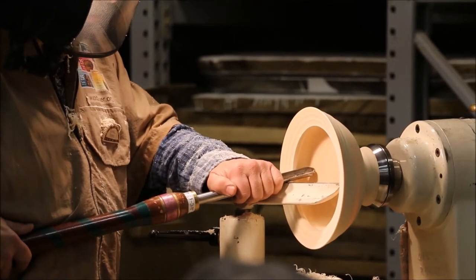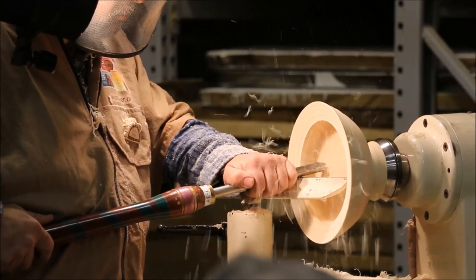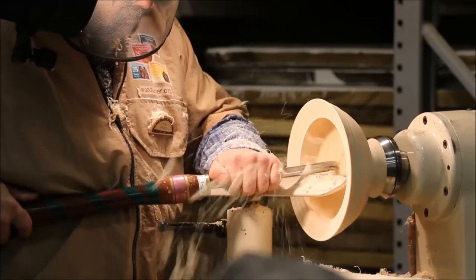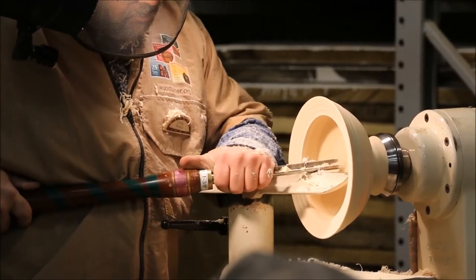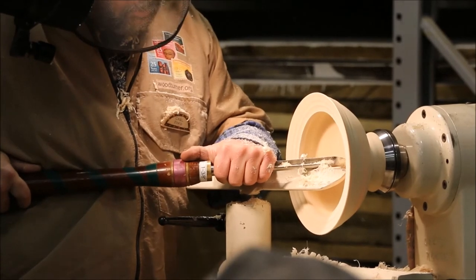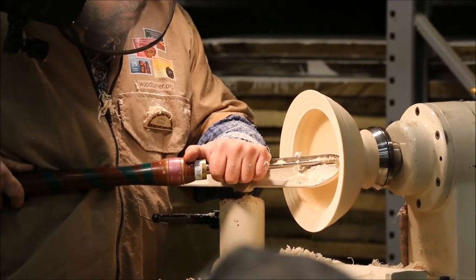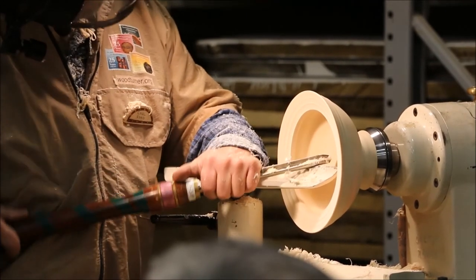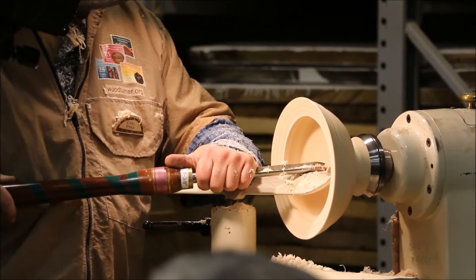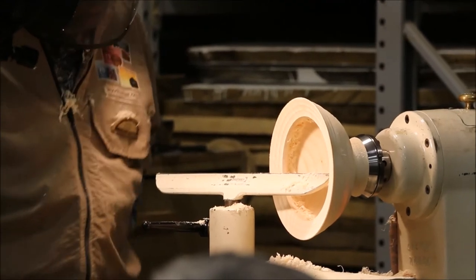So that's what I'm doing each time in here when I start the gouge. I reach in here — it's not starting, it's not cutting. I'll bring the back around a little bit more. There it is; I bring it up, now I go through it. People have a tendency to try to fall down the hill too fast and keep up with the lathe. If you learn to go slow you're better. Here I'll just go slowly right across the middle.